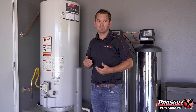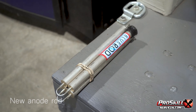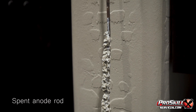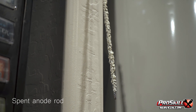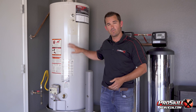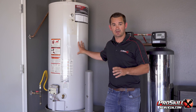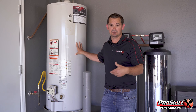To start out, we're going to talk about what's called the anode rod. The anode rod is inside the heater — it extends from the top down to about three-quarters of the way and is made of a more base metal, whether magnesium or zinc. That metal will break down in the presence of water, because the other metal present is the actual steel tank. So you have two metals, and the more base metal breaks down first.